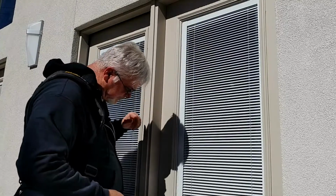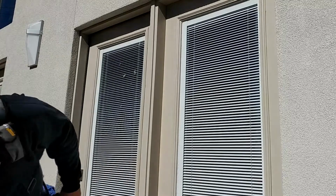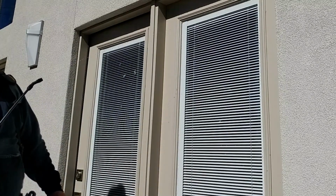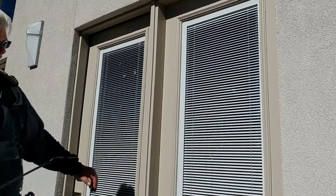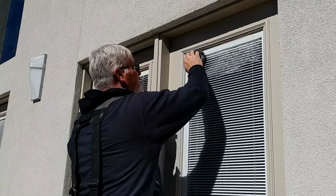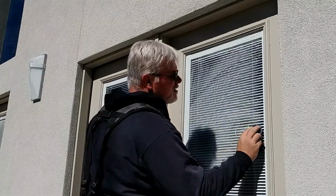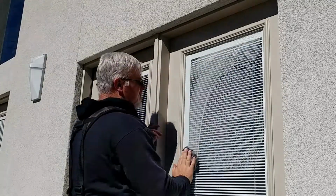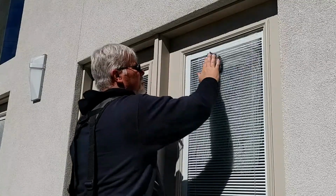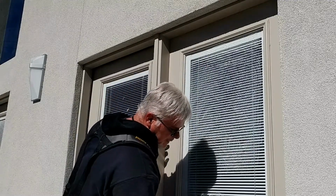After I've gone over it the first time, I make sure that I re-wet the window with a lot of window cleaning fluid. I come back over the areas that I could see that I've missed. Most of the time there are stubborn stucco marks in this area, and I come back and concentrate on them with a razor blade and the steel wool. Then after that, I redo the whole glass with the 4/0 steel wool.